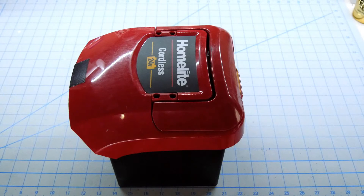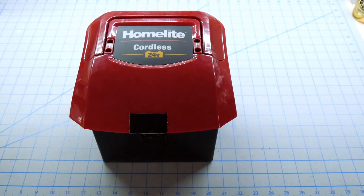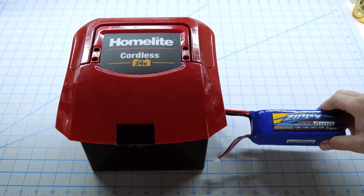Here's a closer view of the battery sitting on a mat with a one-inch grid so you can get an idea of scale. This is a lead-acid battery — there are two 12-volt lead-acids in here, and together they make 24 volts. So when choosing a replacement battery, I wanted something with a voltage pretty close to 24 volts. I like lithium polymer batteries because their energy density means they can source quite a bit of current from a very small package. A six-cell battery is nominally between 22.2 and 25.2 volts — so what that looks like is this.